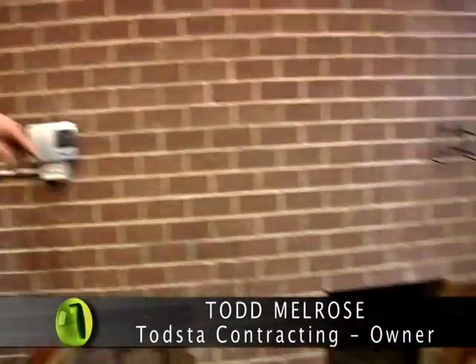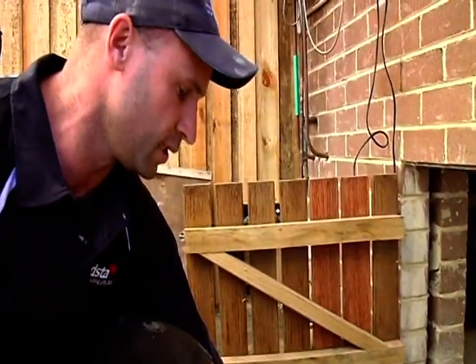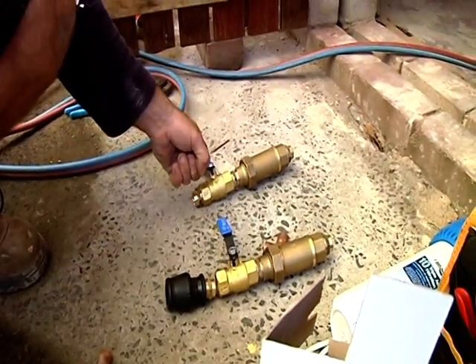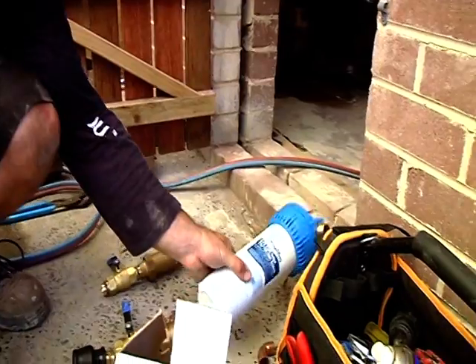What I'm doing for Michael today is connecting his pump from the rainwater line up to the existing laundry line. Water will come up through here from the mains pressure system, and then from the rain tank coming the other way. It will select either mains water or rainwater, go into a T-junction, then through a rainwater filter, and back onto the house to join onto the laundry line.